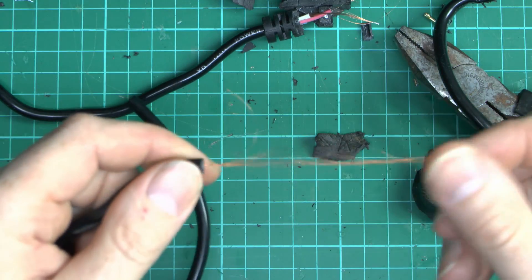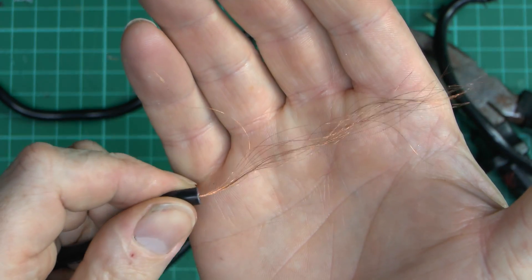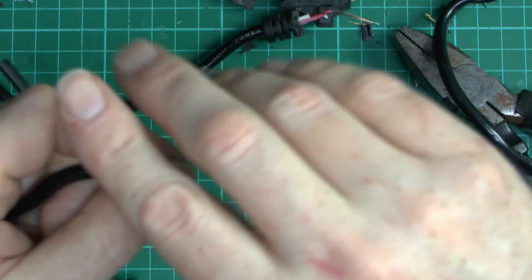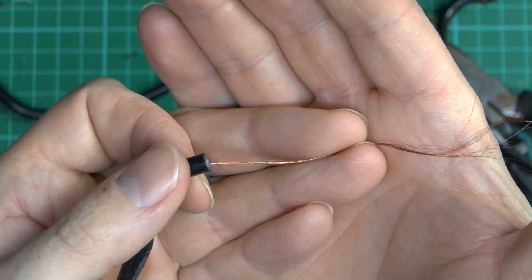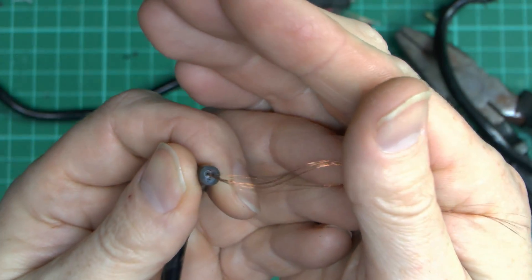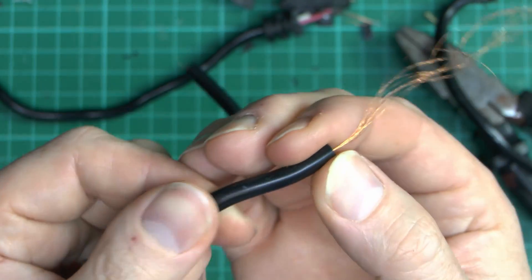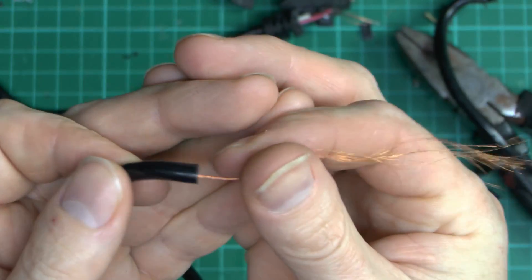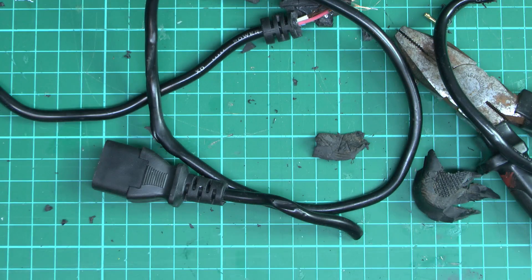As expected, the thing is a complete pile of junk inside - and that is actually all three of the conductors pulled apart. As you can see, there's pretty much none of it - it's as thin as hair. Shoved together you might get somewhere near 0.5mm considering all three are there, but the trick is they've bulked up the insulation to make it appear as if there's more substance. In reality it's 99% insulation and what's left is some kind of copper coated aluminium. Definitely no use for anything. That's it for this time - thanks for watching.